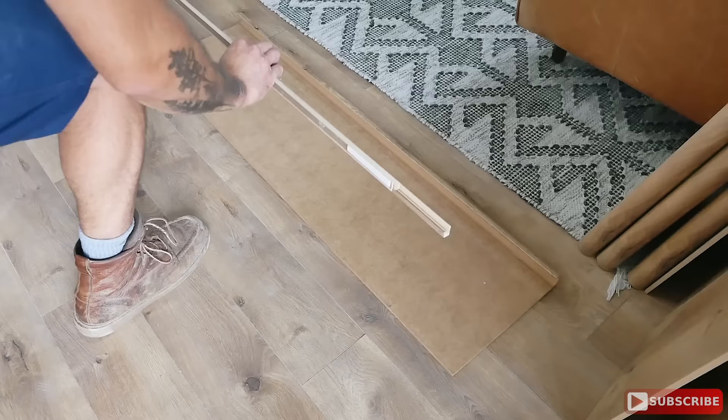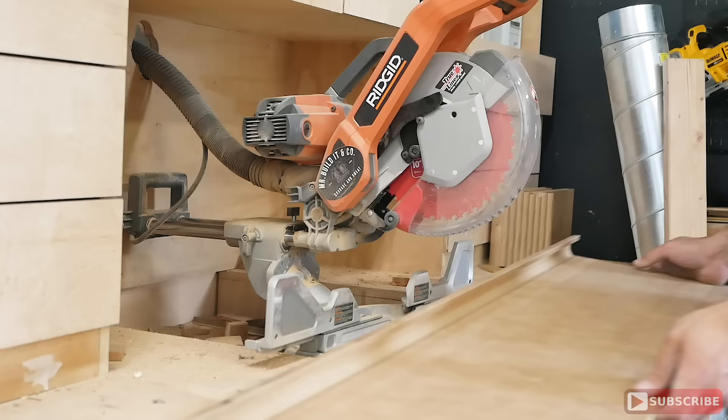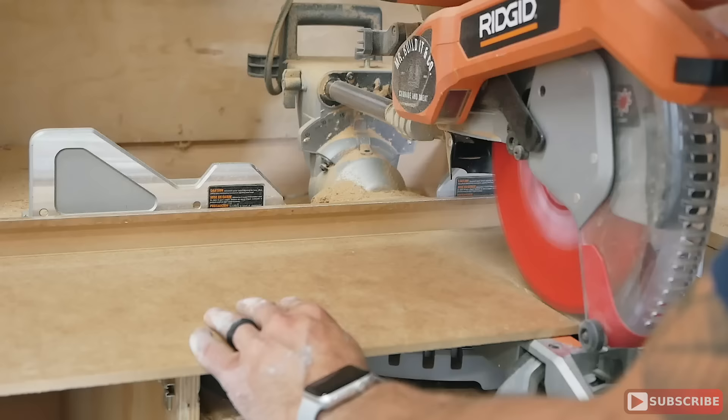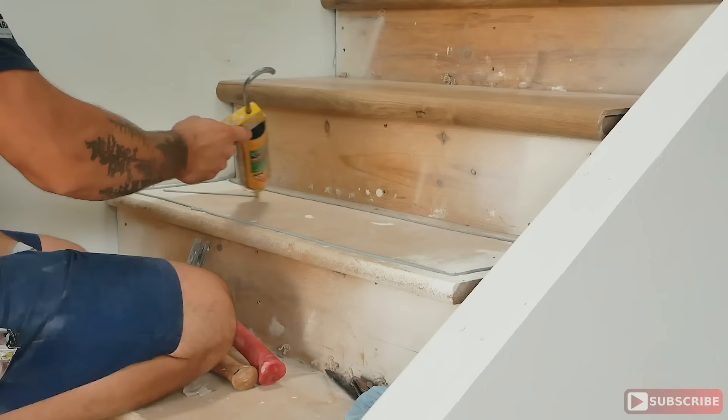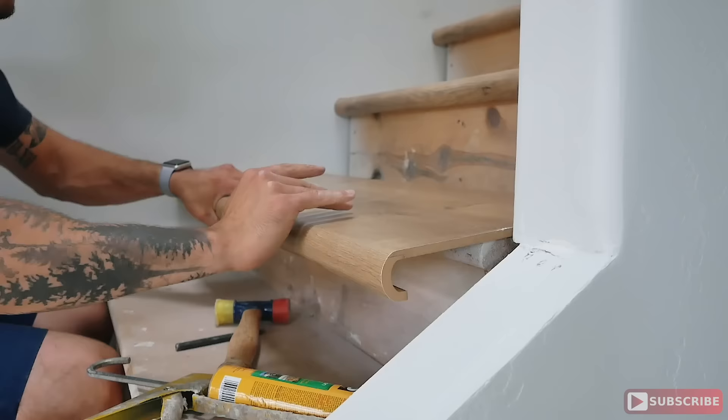Basically I did two little rip cuts on the back of two extra pieces of laminate flooring that had locking grooves in them. I would line up the width of the actual stair tread I needed and clamp it together. I'd bring that custom measurement over to my actual stair tread — which is roughly 94 inches long to accommodate most stairs — make my marking, and then bring it to my miter saw to make the finishing cut using a 40-tooth blade.